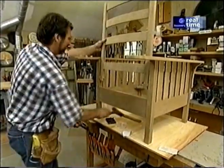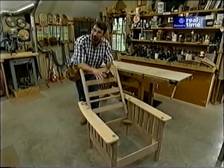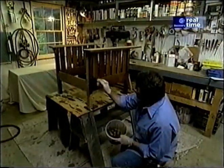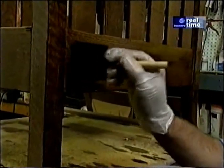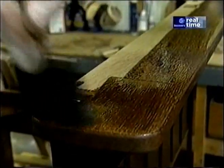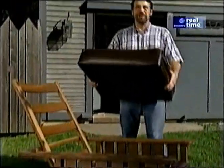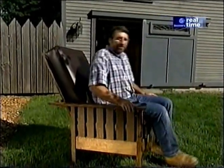Now for the final bit of assembly. A little bit of glue in the holes for the dowel pins. I've slipped the pins through the backrest assembly, and I also made these octagon washers — about a quarter-inch thick, they act as a spacer to keep the backrest from hitting the arms. It's just a matter of getting the whole assembly in position and driving the pegs home. There it is — another Morris chair. All we have to do now is order up some leather cushions and figure out what kind of finish to put on this piece. The antique chair we found in Tucson had sort of a dark honey look to it. I was able to find a Danish oil that has a stain already mixed in that gives me just about the right color, and it really brings out the features in this quarter sawn oak. I'm going to put one liberal coat on, let it sit for about 30 minutes, apply a second coat, let that sit for about 15 minutes, and then wipe the piece dry. We couldn't make the cushions, so we found a quality upholsterer who made some up for us out of good quality leather — it's the perfect final touch. This chair is comfortable.